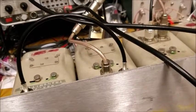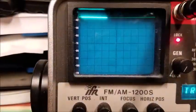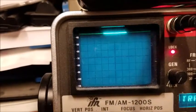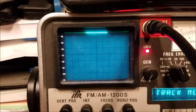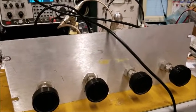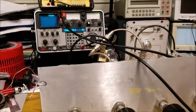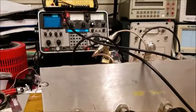Interestingly, it's less than when I was on track low — it was minus 50 down to minus 110, which we would think was 60 dB of attenuation. I'm not perfectly clear that I'm not getting a little bit of feedback from the cables — these are cheesy RG58 cables, so that might be a little of what's going on. Anyway, I think I've tuned this Motorola T1500 duplexer to the frequencies I want to try for our new repeater, and that's what it looks like when you're doing it with an IFR. Buddy, I hope that was interesting for you. 73 and have a good night.